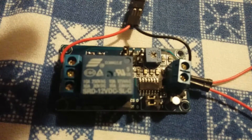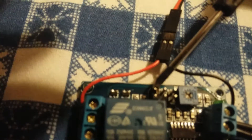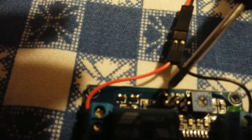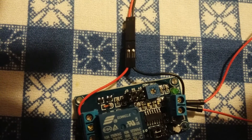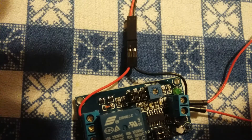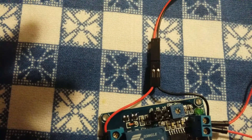Now there's a couple of things we want to look at with this timer. The first is this set of pins right over here. Right now I have this jumper on the S7 pin. So S1, S6, and S7. No idea what S4 does. S6 turns off the timer, so if I were to take my needle nose pliers and remove the jumper from S7 and put it on S6, the timer wouldn't work.